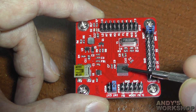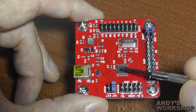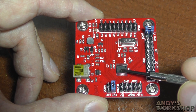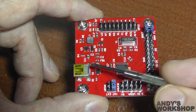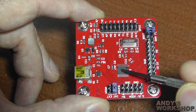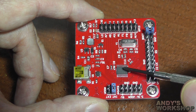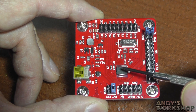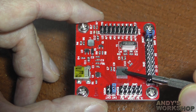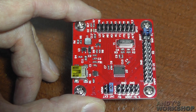Another option for an accurate clock is to use the HSI48, which is unique to ST's MCUs that contain the USB peripheral. The HSI48 is a high-speed internal 48MHz clock specifically designed to supply the USB peripheral, because USB needs 48MHz. What's special about ST's implementation is that they know the HSI48 isn't going to be particularly accurate out of the box, so there's a capability built into the firmware for continually trimming the HSI48 based on incoming start-of-frame packets sent to you from the host every one millisecond. It's quite a neat way of generating the clock and keeping everything accurate.